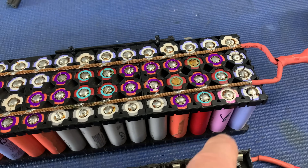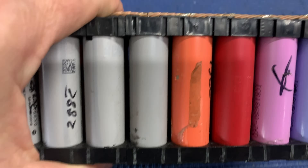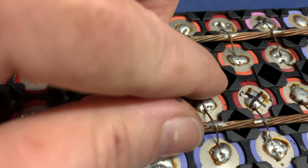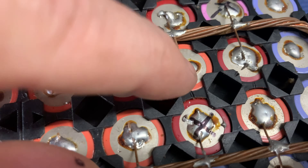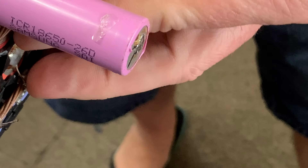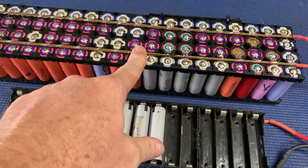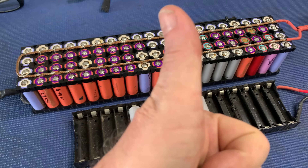The way we do that is we've got the fuses on this side and the heavier wire on this side. So I remove the solder and take the fuses off. Then on this side I'll snap out the little triangles, because on this side it's got the heavier wire to hold it in so the cells aren't going to move. Then all I do is push the cell up and through, replace them with these cells, and re-solder them in. These ones have been balanced to this battery pack — they're within about 0.02 of a volt of each other. So we'll get that done, put this back into production, and see where we end up.